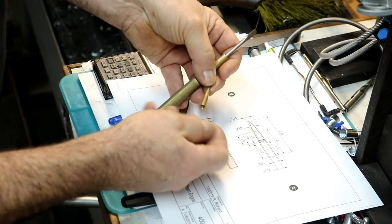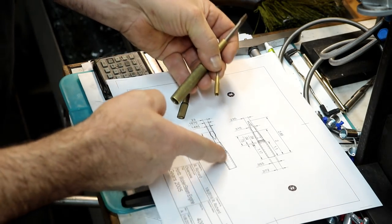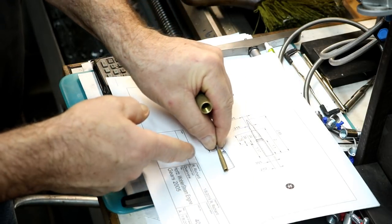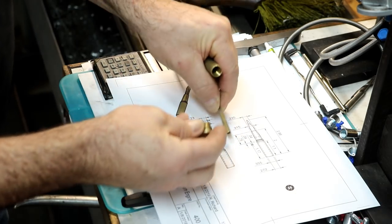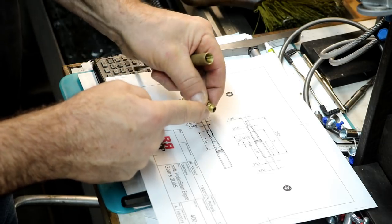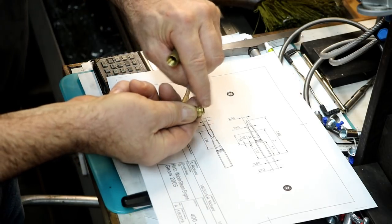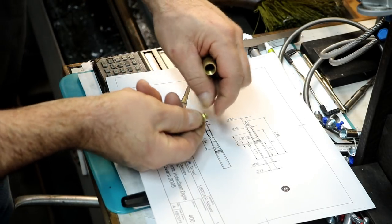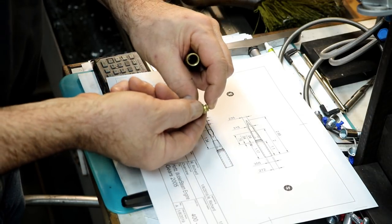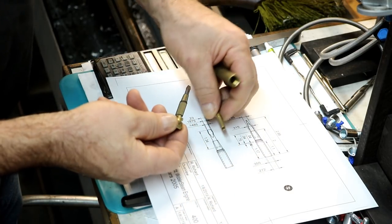So I decided to draw it all up, as you can see here, and I'm going to make one and restore this. This one will go inside the medium-sized one, and then the medium-sized one will go in here. Now, the medium-sized one goes on this cap. This cap is integral. It screws onto the first threads here, which is a little bit bigger than 5/16. It's a weird size, but it's 24. Both threads are 24 threads per inch. So you screw the medium one on there, and then the whole thing will screw in like that, and inside the medium one is this little one.